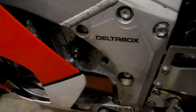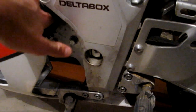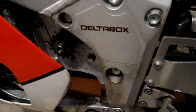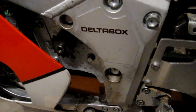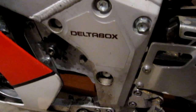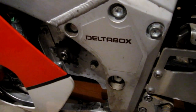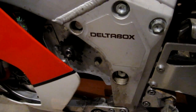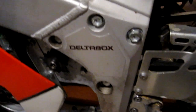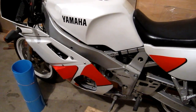On that note, I actually found a source for those metric sprockets I was talking about — the 08B metric sprockets, which have the tooth pattern of a 428 chain. I found some that are going to fit onto the motor shaft with just a minor bit of modification. I ended up ordering them from England because a company in the States wouldn't ship to me. I ordered four sprockets of varying tooth counts so I can change the ratio really easily and have four different gearing options. Once I get those in — probably sometime next week — all I'll need is a couple days of warm weather and I can take her out for her first spin, so I'm pretty excited for that.